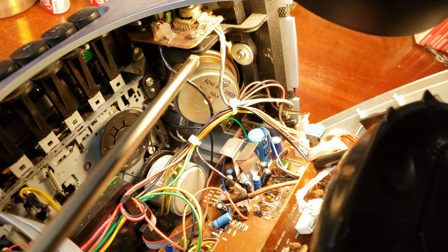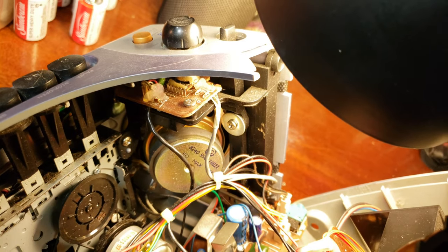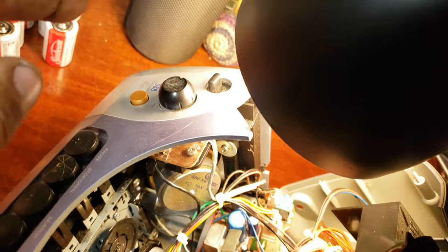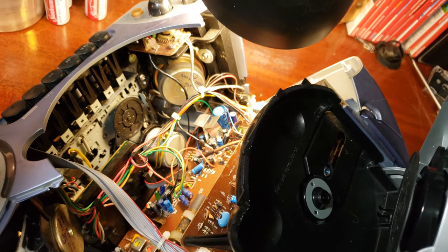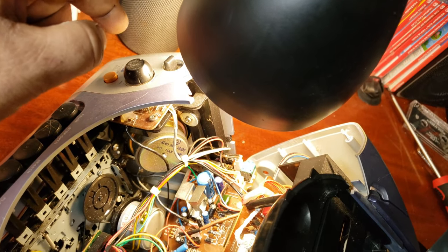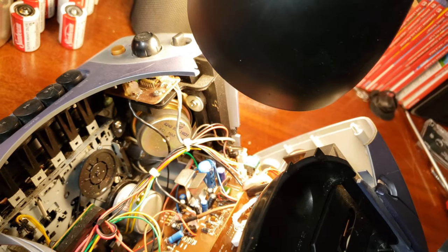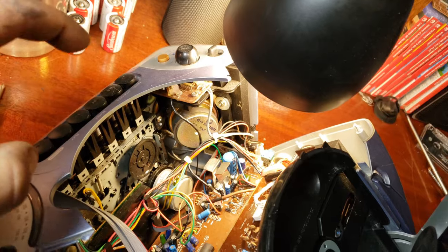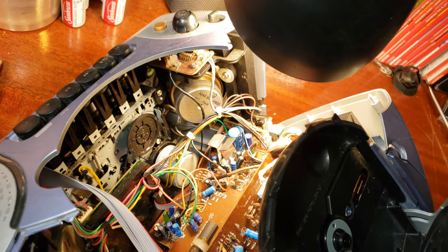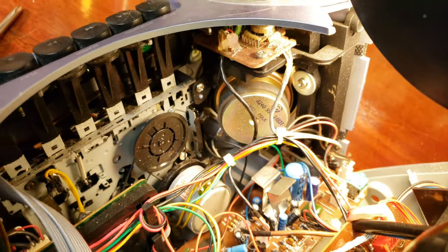Okay, so there we go. Right in there — that's the bottom of the potentiometer. It's kind of hard to see but there's a little hole there, and that's what you want to spray into. I only have alcohol so I'll show you how to use alcohol to get a similar effect, but it really needs to be blown out. I can see this was probably someone's fishing radio or used on a construction site — there's dirt congregated right on that little board that holds the potentiometer. That's definitely why I wasn't getting any sound from the speakers unless I twisted the volume around — classic symptoms of a dirty potentiometer.